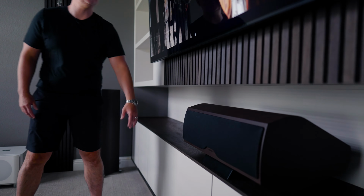And for any home theater, master bedroom, that kind of thing where you don't want sound leaking in or out for a myriad of reasons, get the one that has rubber on it. Change this door from this hollow door to a solid core door, which is like $100. And now you've got a fully sealed, like an attic, solid door. Go to Home Depot, get yourself what's called a sweep, which is basically like little rubber fingers that hang down from the door. They make them in white. It'll slide on the bottom of the door.